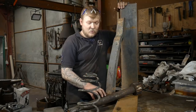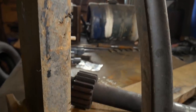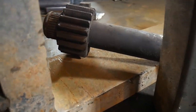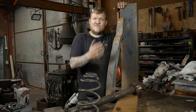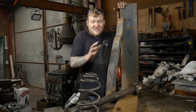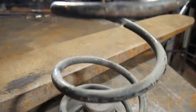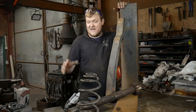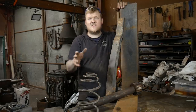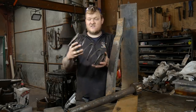What you're looking for are steels that do jobs — but they have to do hard jobs. Drive shafts, for example, have to take torsional loads. Springs are under tension. Forklift truck tines need to be lifting up big weights. I'm using quite large tines here and have the ability to process them. But smaller drive shafts can be anything from an inch in diameter all the way up to two inches and an eighth, so you've got varying sizes of these materials available all the time.